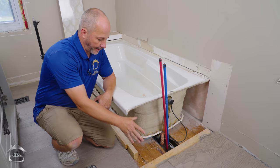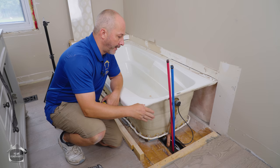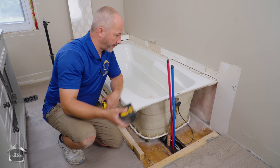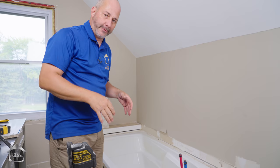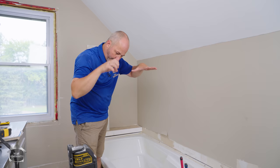Basically I'm going to put a leg here, a leg there, something like a 2x4 across the bottom for stability, a 2x6 across here so I can attach the tub to the structure — that leaves nothing but space so that when my plumbing comes tomorrow I can put in a proper backer piece. The other challenge is the floor has a slope, so I need to use a laser level to draw my line to build my box level. Just because your floor is not level doesn't mean you want to build everything else not level. Your counter's level, the tub is level, I want the box level, the tile should be level — and you want everything to grow down and make contact with the floor.